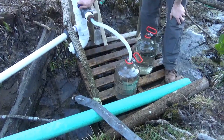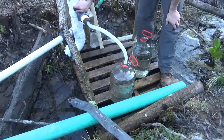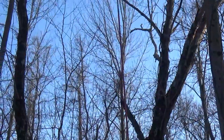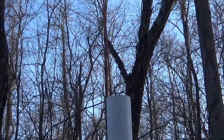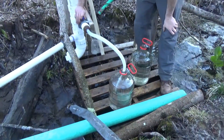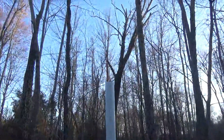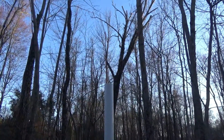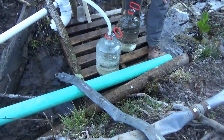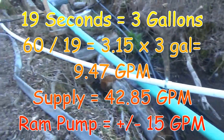In this test we're filling a jug full of spring water and we're basically going to dump that two-inch valve wide open into the three-quarter inch tube that feeds to the jug. I'll show you where the standpipe gauge is at while the pump is running and then give you a shot of that while the jug is filling. The jug is filling — you'll notice it's filling very quickly. You can see our standpipe gauge registers a little bit lower, but the pump continues running so we have enough water to fill that jug, which is now full, and at the same time run the ram pump. So that's a good indication that our supply line upgrades are successful.